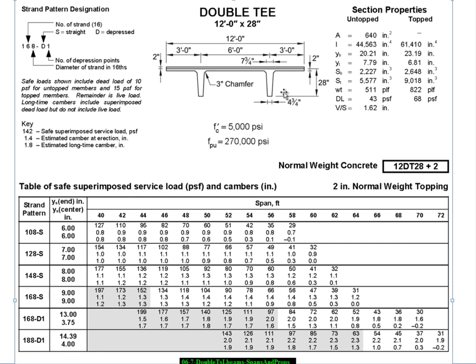We have to smooth out some of that camber. Also, the double T's are never cambered to exactly the same height, so there will be little edges where the two members meet. If you tried to put carpet down on that, the carpet would become quickly damaged and people could even stub their toes on the slight irregularities from one panel to the other. The topping layer is a way of smoothing all that out in the field to give a satisfactory finished floor.